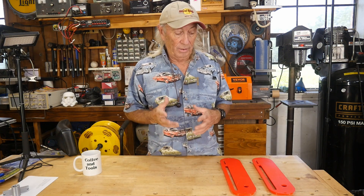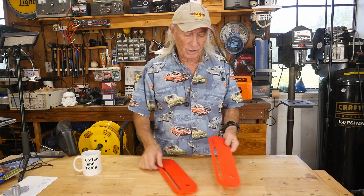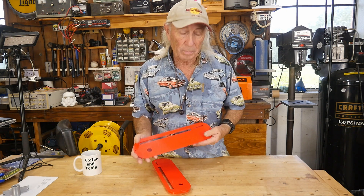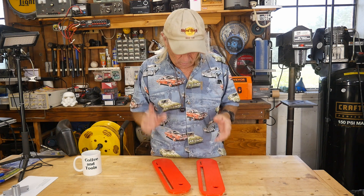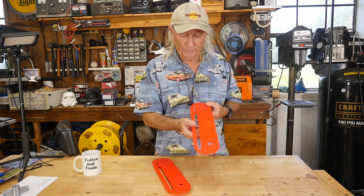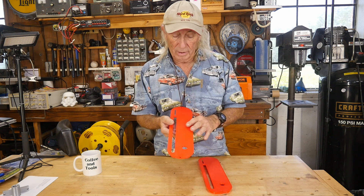I had a breakthrough yesterday — it sort of made sense but also doesn't make sense. I've got two test product cases here for 3D printing. I have some really old printers, kind of like a CR-10, that just crawl along putting filament down and take forever. One of these was printed in about 13 hours, and that's the problem with old-style bed-slinging printers.